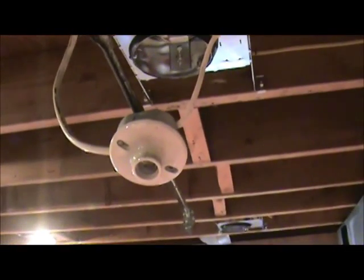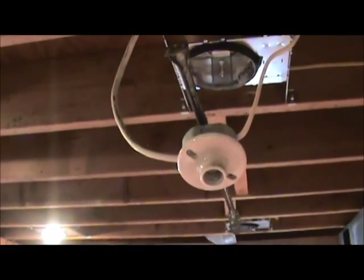The way it's wired right now, the main power comes across and drops down onto this light fixture, and they used a three-wire configuration — they kept one wire as main power and brought it over to the other light fixture. Essentially they separated the power line so they could tie it back into wiring that went to another outlet inside, an outlet outside, and also wiring up here that went to an outside light above the garage area. That's going to get a separate power line; I'll put a box in just for that to draw power off for the light switches and reestablish that connection.